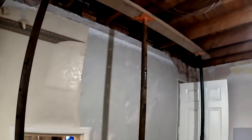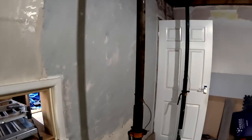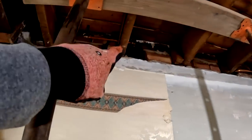Okay. We are solid there. Three Acrows down onto the concrete where the floorboards come up. Now, what this is doing, this is obviously holding the floorboards up and the upstairs, and it's holding the wall up. Where the joist goes through into the wall, that's now holding the wall above. Not sure how high that wall goes, but the wall stops here. I'm guessing that returns where that return is, and that goes up.